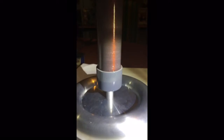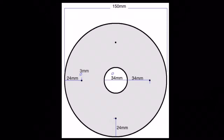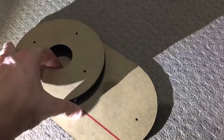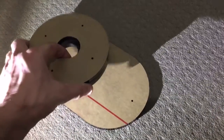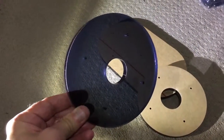I've got another 150mm torus from High Voltage Shop on eBay. You can see a sneaky arrangement to lead the wire up the center of the tube, and I've clear epoxied the coil. These shapes might look out of context now, but they were good enough to send to a plastics company and have laser cut in 10mm gray tint acrylic. The very next day a box shows up at the door with the fabricated shapes — two discs and a base for the coil assembly. The rest of the hardware will have another base plate which is slightly bigger. Basically this is a three-tier structure that supports the coil and primary, all bolted together with standoffs.